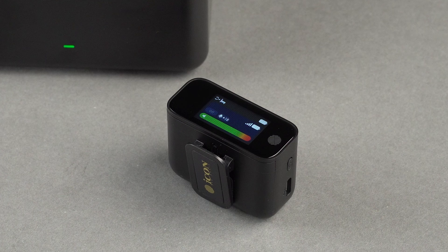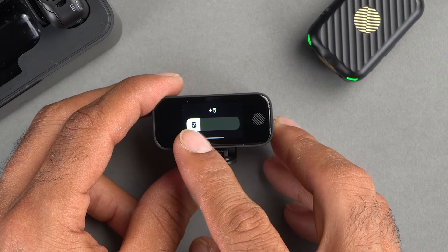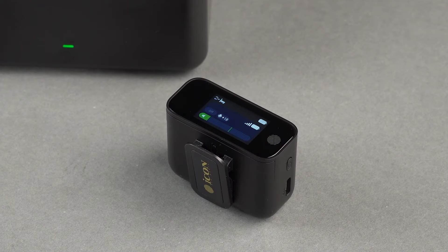If you're new to working with microphones, clipping is a form of audio distortion that occurs when an amplifier is overdriven and attempts to deliver an output voltage or current beyond its maximum capability. You'll know you're clipping or close to clipping when you see orange or red on the output signal on the receiver. If this occurs, you'll want to try reducing gain a bit so you just see green, and you'll want to maintain the signal level that peaks just before any signs of clipping are seen on the receiver or audible distortion occurs.